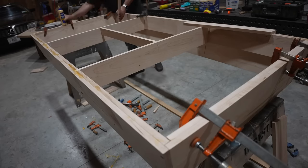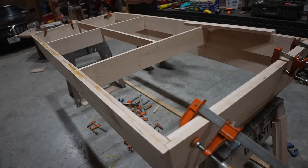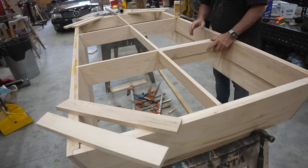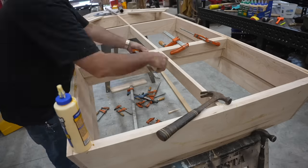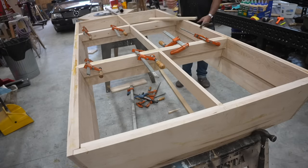I'm starting to build up those layers. I needed to take each one of those pieces on the table saw and flatten the top, bringing them into a 15-degree angle. All the side pieces had to be cut with a small 15-degree angle off the top of each long side.